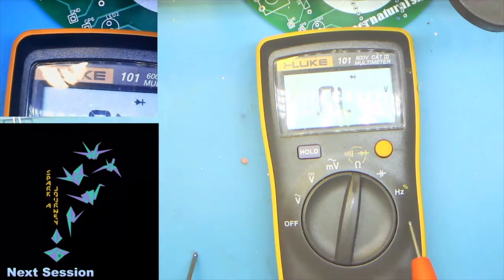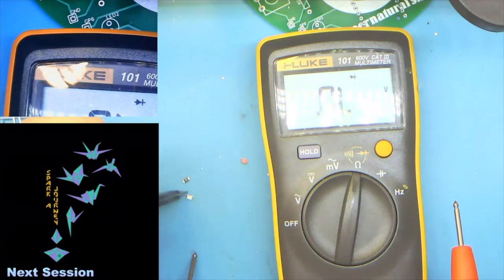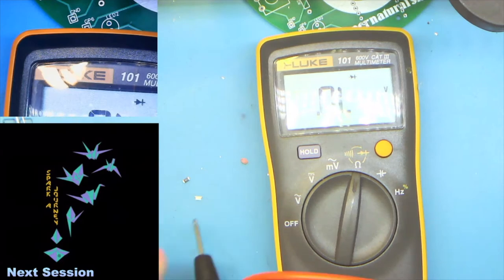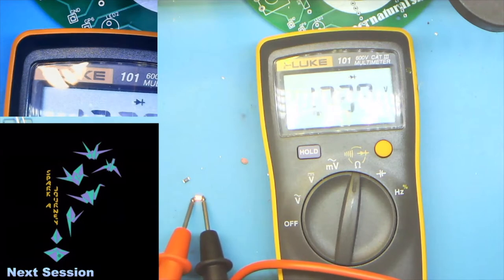And it really becomes important later on to have these features because as you grow and get into more advanced things, that little dot there is actually a resistor. And this little dot here on your screen is actually an LED. It's surface mount. I do believe it's an 805 package. They come much smaller. But there again, trying to figure out which side is which is much easier to do with a multimeter.